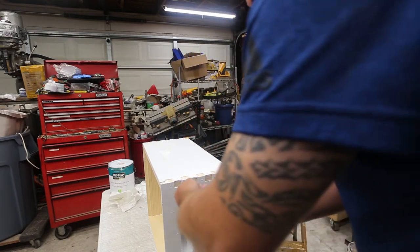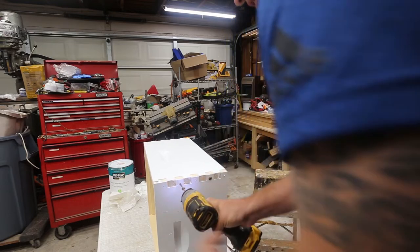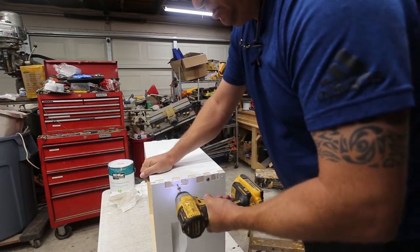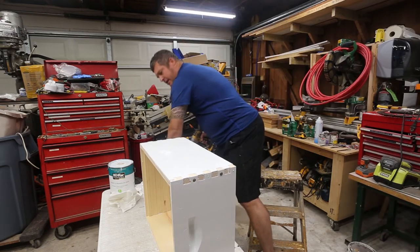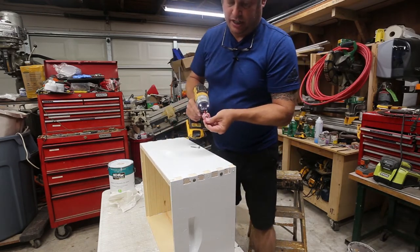This is one of the reasons I'm using screws — they're just better for getting the joints to seat. I do recommend that you use a good quality screw like these GRK or SPAX screws. Now, it is important that you screw both sides.